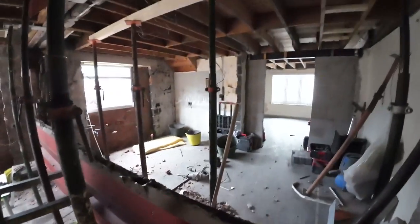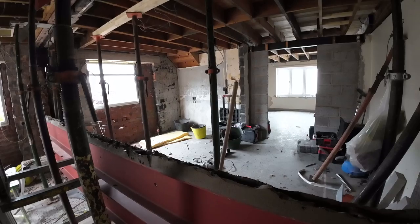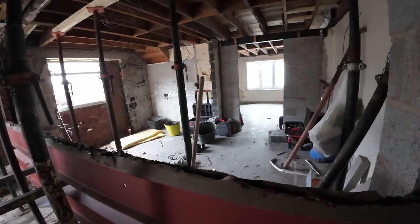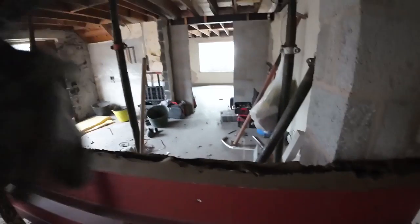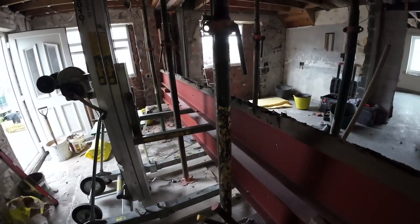Always put your bed on first, wheel it in position, then. In fact, looking at it now, I've just realised I've made a big mistake. We're doing the inside steel first, and that's got a tight bed. And I've put the big bed on for this side, so I'm going to have to go along there and take half of that mortar back off again. So I'll be back in a second.